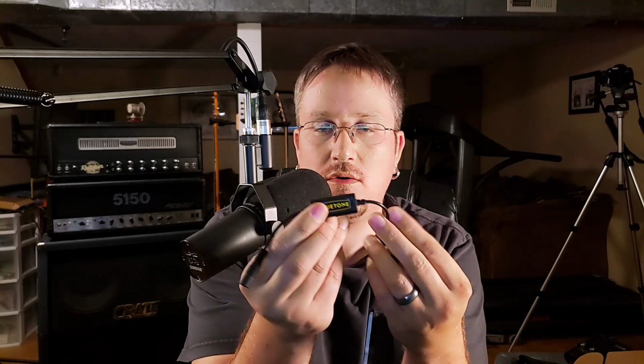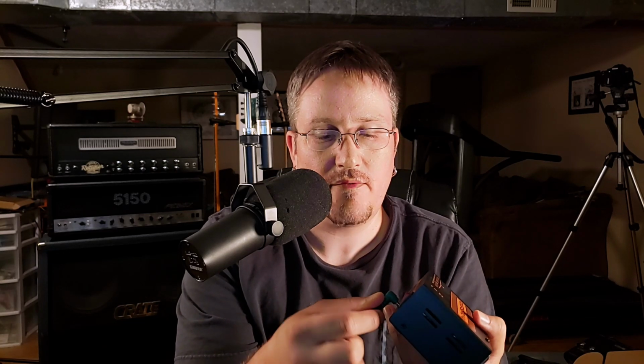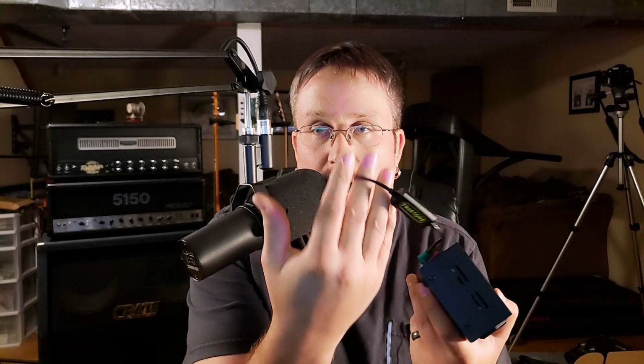So I mentioned that you could use all 8 power taps on 9-volt pedals. What that would require is called a voltage divider, and that looks like this. Voodoo Lab probably sells something like this, but I think this little guy costs around $15. What you would do is flip the switch down to 18 volts, and when you plug this in, it will divide that 18 volts down to 9. And voila, all 8 outputs can now be used for 8 9-volt pedals.